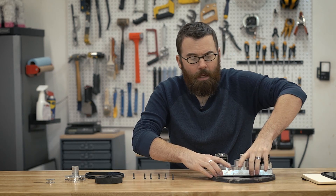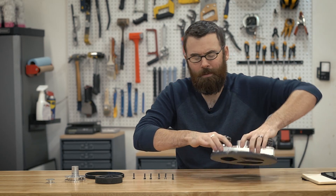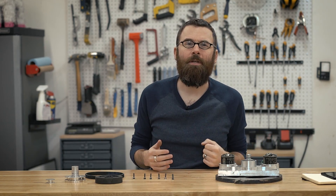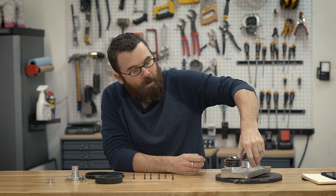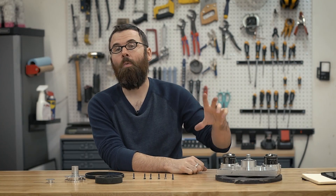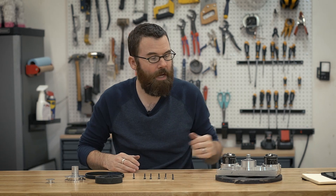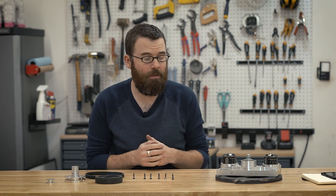Going forward, I'm probably going to make a few little changes. I got a lot of criticism initially for the size of the weapon tooth — yes, people on the internet criticized me for the size of my weapon tooth. I used a relatively small tooth because I didn't really need to take a big chunk out of people; I just wanted to scare them a little and keep hitting them repeatedly. For the next version, I'm going to do two different weapon sizes — a slightly bigger one and a really big one. The really big one will be used mostly for softer targets like aluminum or plastic, and the medium size will be used for most battles. I'm still keeping this weapon too — they'll all be interchangeable. This one will be used for people doing silly things like having a solid S7 tool steel chassis.